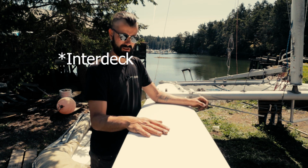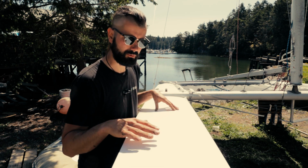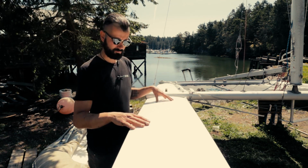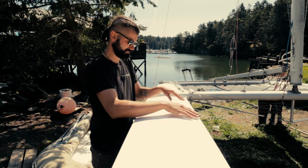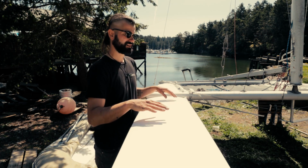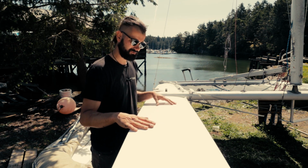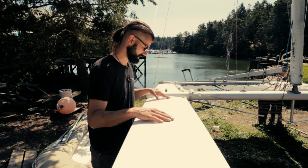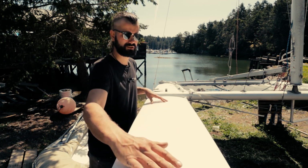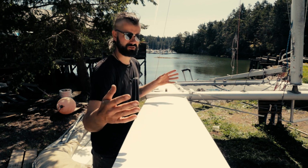This is deck coat. It's quite affordable. It's a product by Interlux, and as long as you put on a really good primer, and I swear by that pre-coat primer that I use, this goes on, it looks like just primer itself, but it feels much stronger, a little bit stickier, kind of like a wet sandpaper. You feel like you can't really slide on it, but there's not really actually that much texture. So later on down the road, I might put a solar panel here, and I don't have to scrape off all the material to glue down the solar panel smoothly, because there's not that much structure. I'm able to just glue right over it.